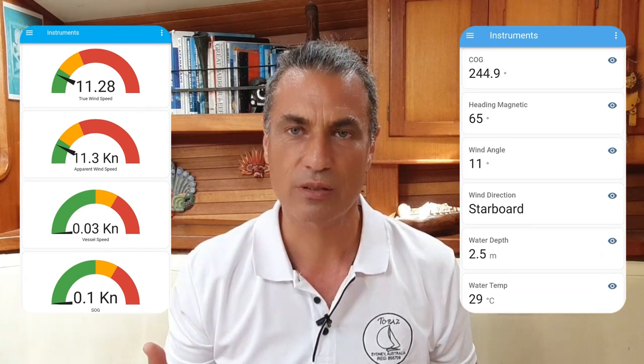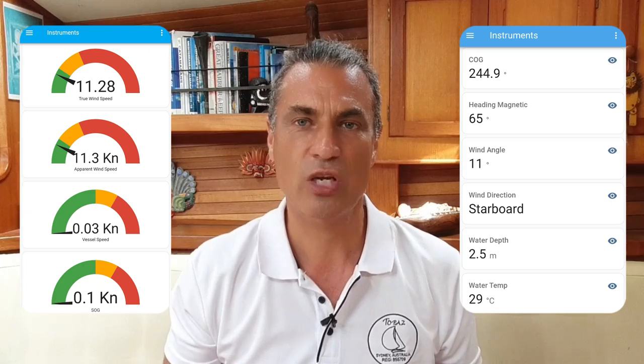With this system, I can monitor all my boat's instruments from my phone or tablet, whether I'm away from the boat or on board. I can set up customized alerts and alarms such as depth and wind speed alarms, and even monitor changes in the wind direction. When I'm sailing, I can set up alerts based on as many of the boat's instruments as I like. For example, if my boat is steering to an angle to the wind, I can set an alert to make sure the boat stays within a range of compass headings. Or if I'm steering to a compass heading, I can be alerted if the wind changes direction or if the wind is higher or lower than a preset wind speed. You can get really sophisticated and set up an alert for when it's time to reef the sails, with different wind speed limits depending on whether you're close or on a broad reach.